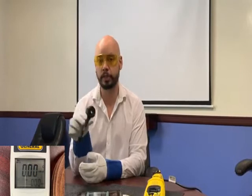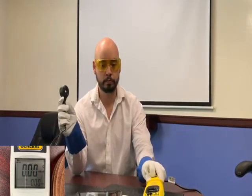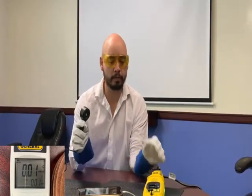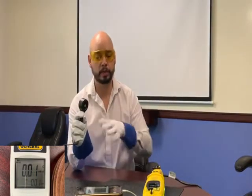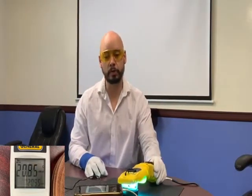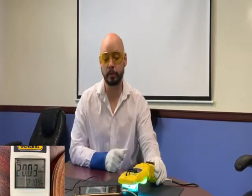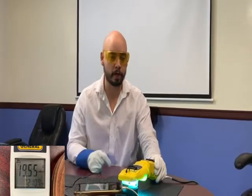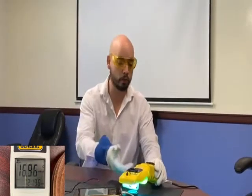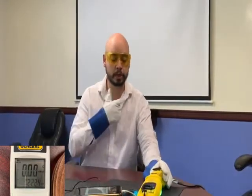This is a UV-C meter. I've set up the other camera so you can see how much UV-C is hitting it — it's pretty sensitive. I'm going to turn on this light; it's the 18-watt system. Even right here it's reading something, so it's probably reflecting on me and I should be wearing some protection. Up close it hits around 20 milliwatts per centimeter squared, meaning even three seconds gives you 60 millijoules per centimeter squared — the recommended amount from the University of Nebraska paper to reuse masks. This is a ton of UV-C, and just like it's useful for sterilizing groceries and shoes, you want to protect yourself so you don't get a skin burn or hurt your eyes.